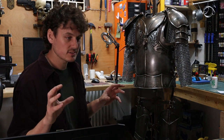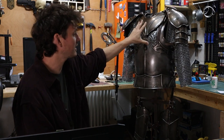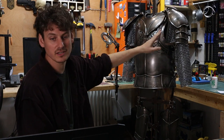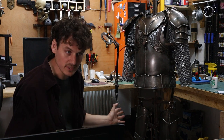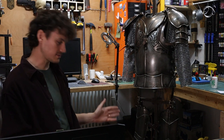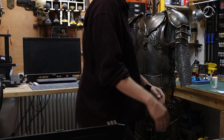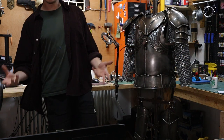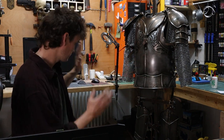I'm going to do this video a little bit differently and loosely explain what I did at the beginning to get my arm looking like this — black with stencil detailing, which you apply before you start bluing it. Essentially, I initially remove the grease from the armor, which inevitably builds up between events. Steel armor gets rusty, so you need different gradients of steel wool, some WD-40, and some Pink Stuff or other polishing medium, which you apply to the rusty areas with a bit of elbow grease.